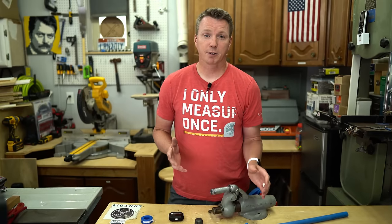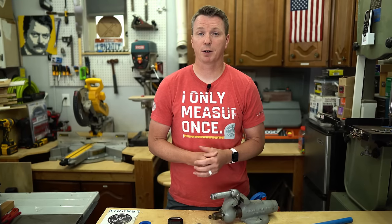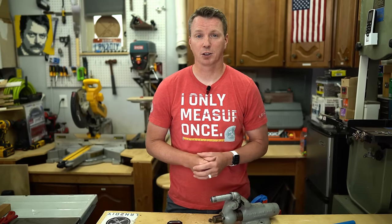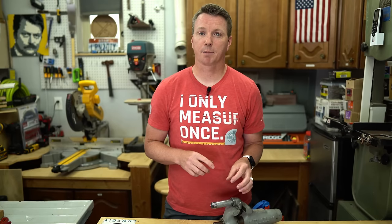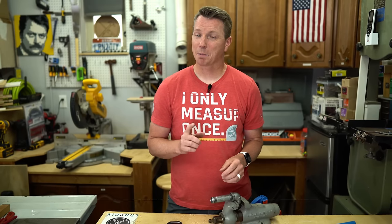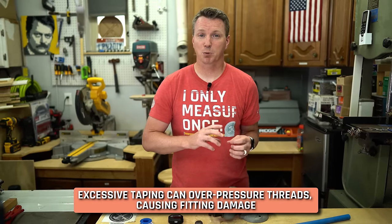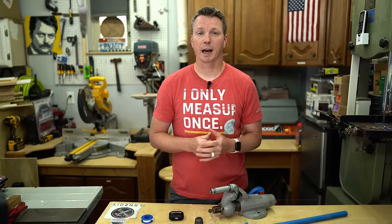That said, a lot of people agree it's sometimes okay to put a little extra Teflon tape on something, especially if you're not getting the seal you're expecting. Try it without tape first. If you have an old o-ring or rubber seal that's not holding well, ideally replace it. If that's not an option, try combining that seal ring with some Teflon tape — that may do the trick. But putting too much on can cause the threads to have too much pressure and crack or split the fitting, so avoid that as well.